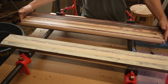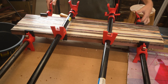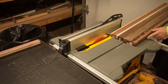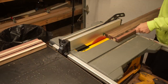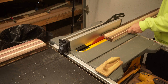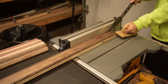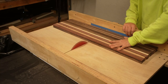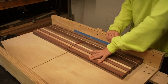What were two 12 inch panels now combine to make one 12 inch panel, but they're thicker than they were before. Your third set of cuts will, like your first cuts, be the thickness of the boards, so you have squares that you can rotate 90 degrees and get a good mix-up on your pattern. At this point I decided to cut my panels in half — so they were 32 inches, now they're 16 inches.